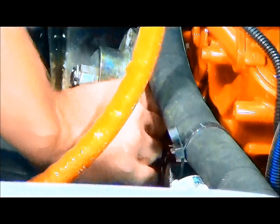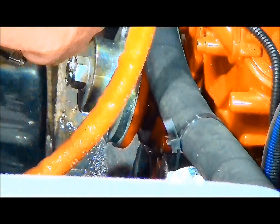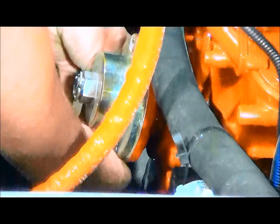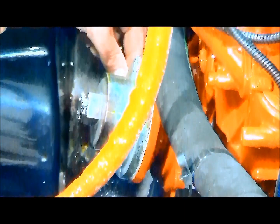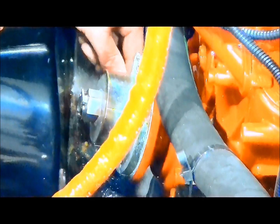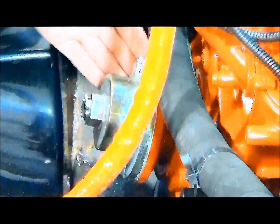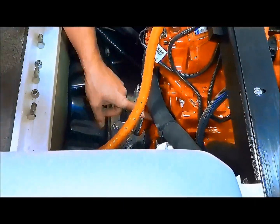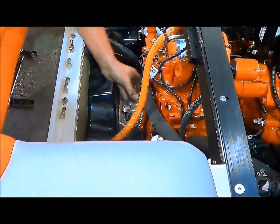On this engine, we're binding on the top — you cannot move the three thousandths gauge any further up on the top, but I can completely remove it around the bottom, and it stops a little short on the starboard side. So what that means is that the portion from nine o'clock up to about one o'clock on the coupler face is tighter than on the bottom.